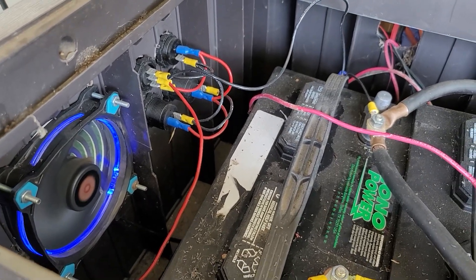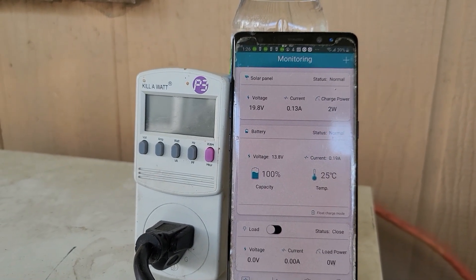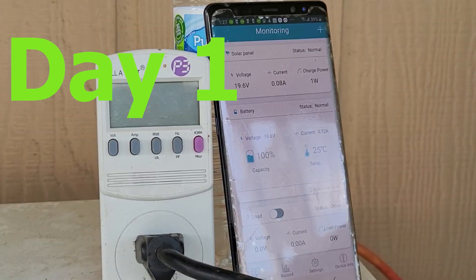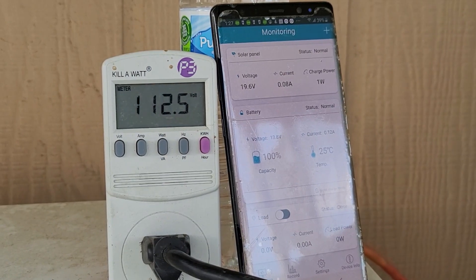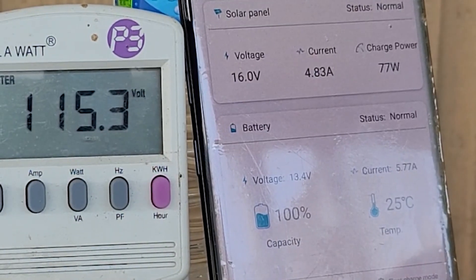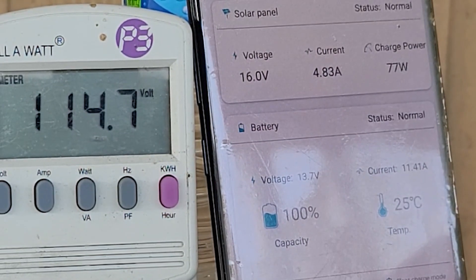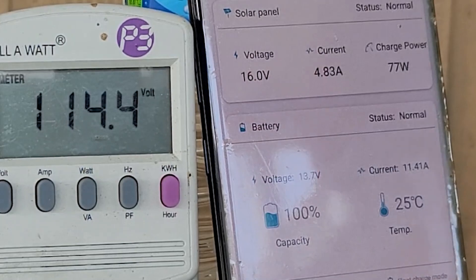For my first day of this test it's a little bit cloudy, but I do have high-efficiency panels so it should work fine. Right now I'm going to click on the power inverter and you're going to see the PWM charge controller allow more amps into the battery bank. It's now 1:27 PM and it is a cloudy day — it was raining earlier today. I'm pulling in about 4.83 amps. After turning on the mini fridge...